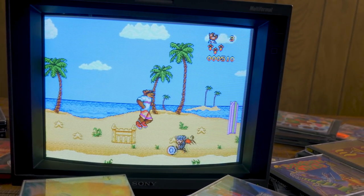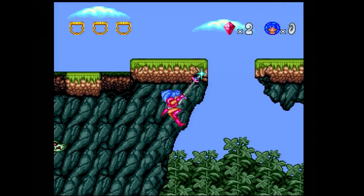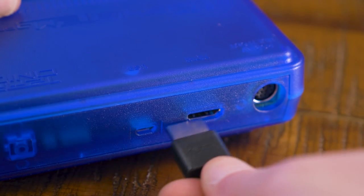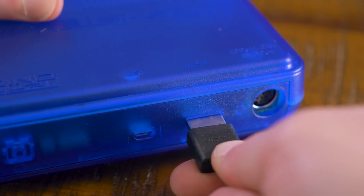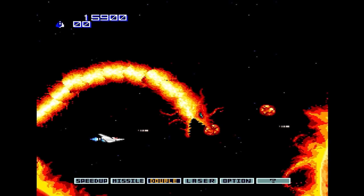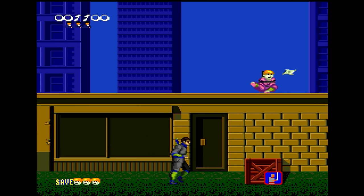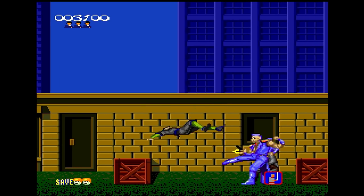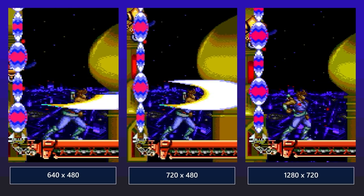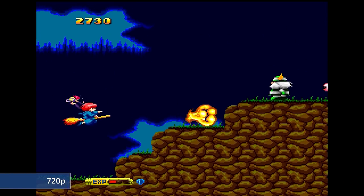The Super HD system outputs analog composite, RGB, and component video via a Genesis 2 style DIN plug, while the HDMI output offers 640 by 480, 480p, or 720p. While the Super HD System 3 is tapping the digital pins to rebuild the video image, this isn't the same as how, say, the PS1 or N64 digital mods work. So just be sure to level your expectations. If HDMI output is the main hook for you, it looks really great, if you don't mind being limited to 720p. Of the three resolutions supported over HDMI, 720p is likely the one that generates the most interest, not just because it's the highest, but also because when combined with the sharp filtering option, you get an integer scale of all the system's different resolutions evenly within the frame.